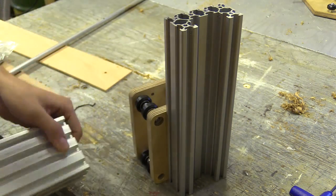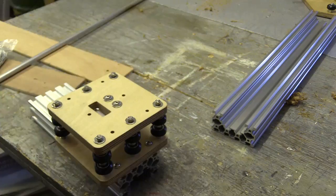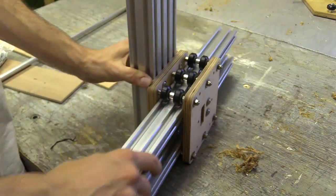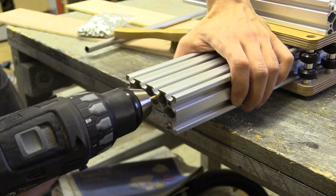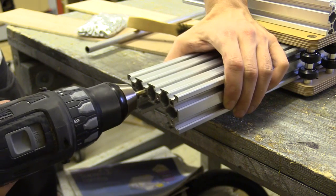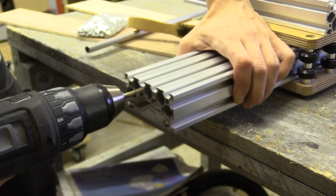Here I'm struggling to fit the gantry plate assembly on the C-beam, and this was because I hadn't tightened the machine screws so they would clear the aluminium. Once that was done it went on nicely and I could start tapping the holes of the aluminium extrusion. The C-beam mounting holes were already tapped, but I'm using longer machine screws so I need to extend them.